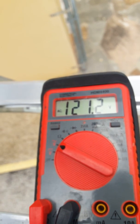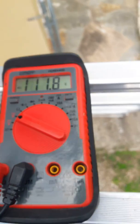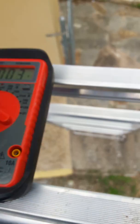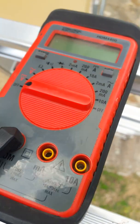That's 120, 120, 120 - so this circuit is still on. We need to find the other breaker panel and turn this circuit off. I have a suspicion we might be able to find it outside.